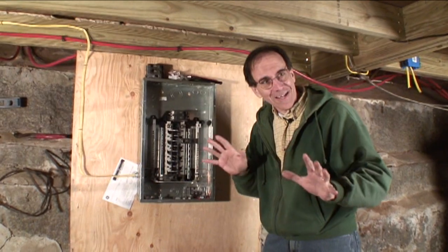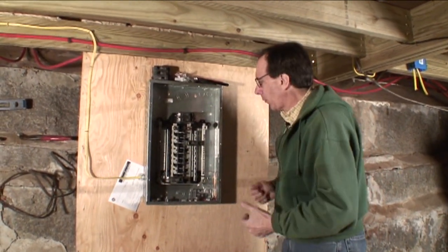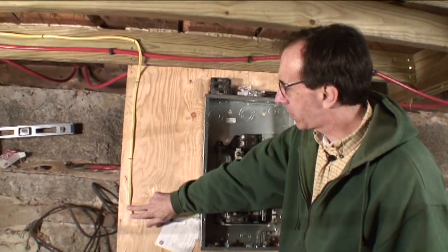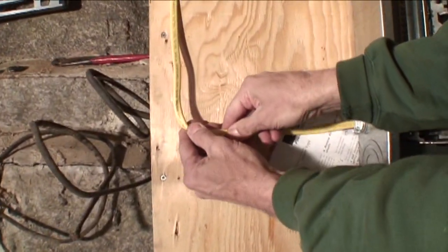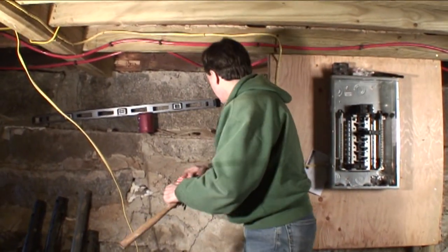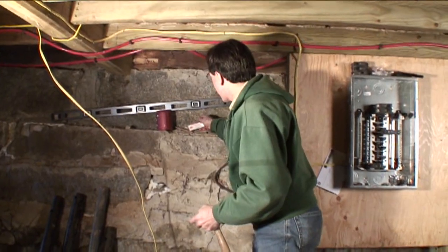It's nice and safe right now, and I like it that way because I don't have to think twice. Now, this circuit here comes down and you notice the nice right angle. I should have a staple here — I don't, but I'm going to put one there. I've got my staples and hammer, and wire staples are not expensive. You don't scrimp on wire staples.